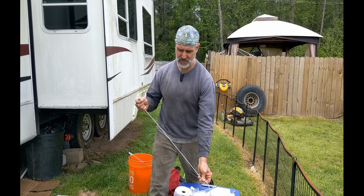Because this one is square, we're going to measure back from that one a certain distance, equally on both sides, to mount these. And then we'll pattern that out on this so that we can pre-drill our mounting holes, and then we can just put it up there and mount it. To give the right space in between these, I want 5 inches. That should be right there. 3/4. So we need to come in 8.5 on each side.